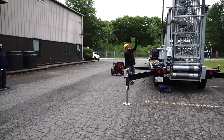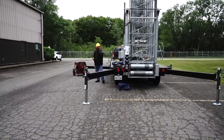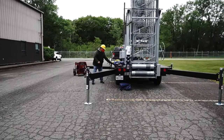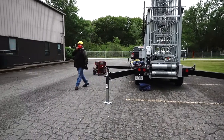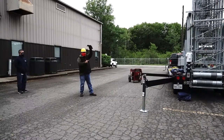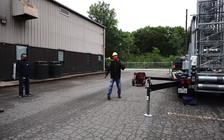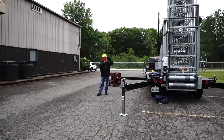But I see only this side. I don't see the other side. So that's why when the tower is coming down, I need eyes on both sides and all around the tower. What happened? The cable does this. That's why I have the guide wires when I'm testing. Put it, poof, and you see the cable, poof. Tense the cable again, because it's nothing. Something blocked my roller. And like that, I don't send somebody climbing the tower to see the problem. That's it, just the guide wires.